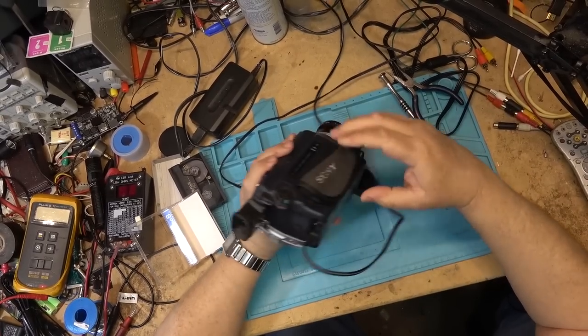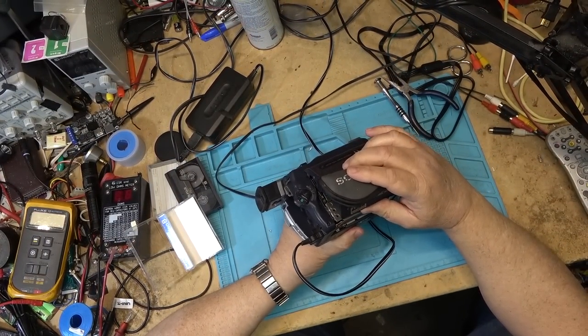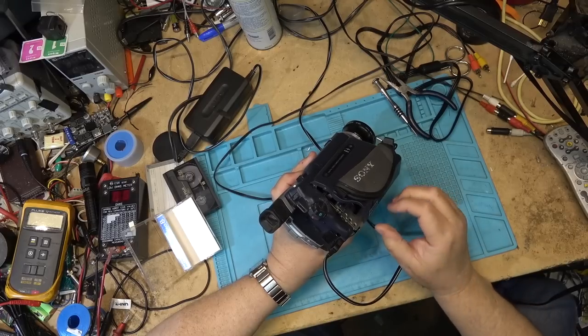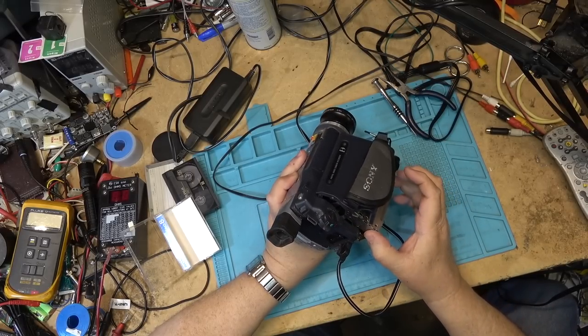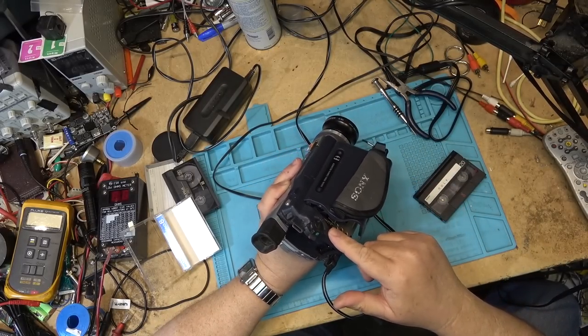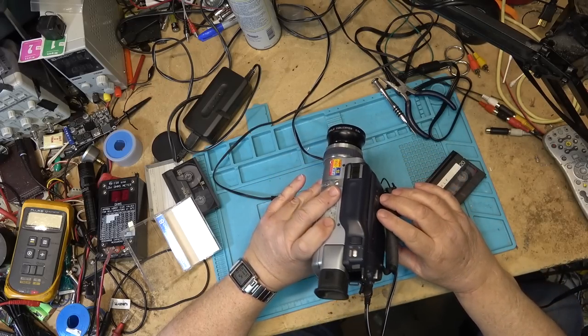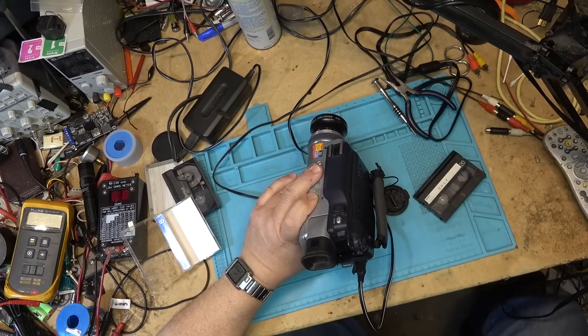So that's how you go about cleaning the switch on one of these. You've got to really disassemble the entire camera to get at the switch. You don't want to just start spraying cleaner in here because you'll get it all over the mechanism. So you really do have to take it all apart like I did to get to it, to clean it up. Anyway, thanks for watching. We'll catch you in the next one.